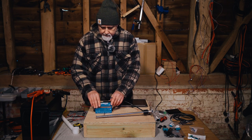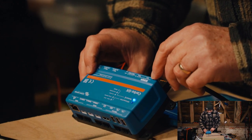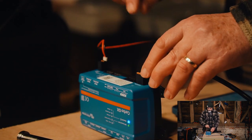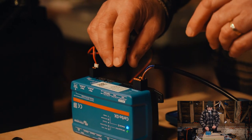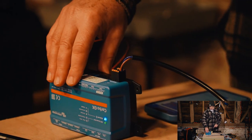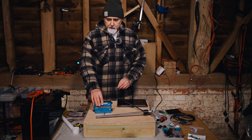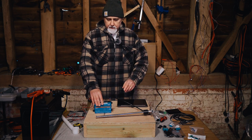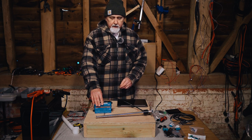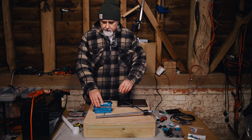On the CERBO GX at the end here, you have your tank inputs — you can see tank inputs one, two, three, four — with a little block that you plug in and connect up to four tanks to the unit. With the CERBO GX you can monitor four different levels. I'm not interested in my gray waste or anything like that — all I want is the level of my fresh water. In a future episode I'll be doing an LPG tank level sensor and show you how to set that up, but basically it's the same thing.